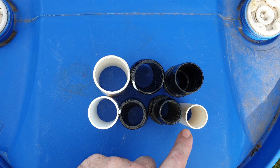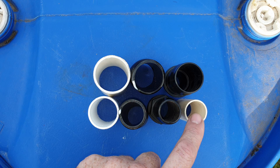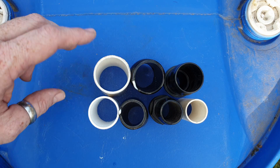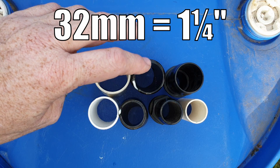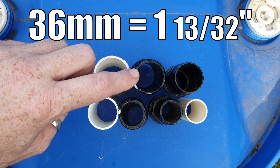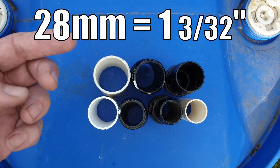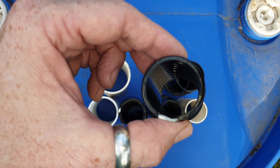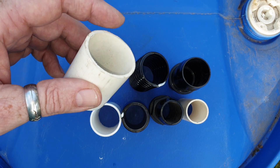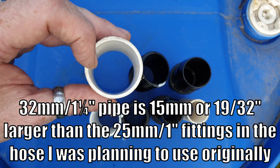For comparison, a 20mm or 3/4-inch PVC pipe fitting has an internal diameter of 22.5mm — which is actually larger than the 1-inch reinforced hose barbed fitting. Up the back, the 32mm or 1-inch-and-a-quarter pipe has an internal diameter of 36mm, the corresponding hose is 32mm, but the barbed fitting reduces it down to 28mm, and this fitting has considerable ridging on the inside which over time would reduce water flow. Because it's only a 6,500-litre-an-hour pump and there will be some head height and pipe friction involved, that's why I've opted for the larger diameter pipe — to get as much flow rate as I can.